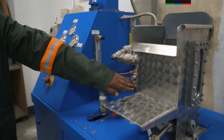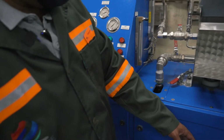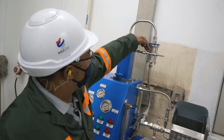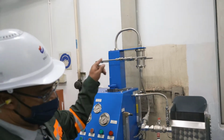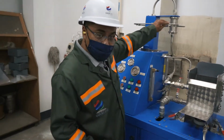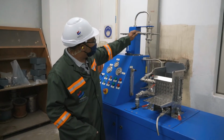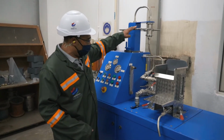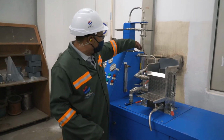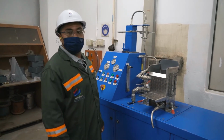And here's the suction line that's going down to a pump, which is housed behind these panels, which pumps back up underneath here into the MACH and then into the cell. So we recirculate on this float cell via the MACH reactor. This ring main is the air injection point into the MACH. So we're adding air to the MACH when we're operating using this rotameter, and then we add air to the cell separately afterwards for flotation.